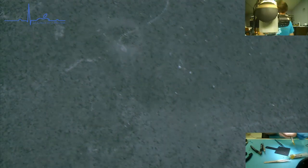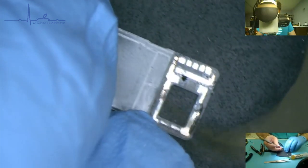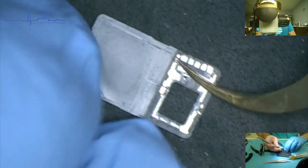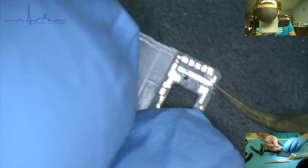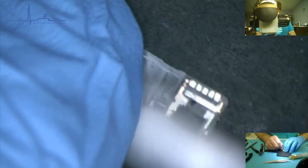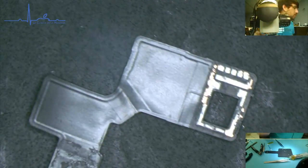So, for the sake of practice, let's go ahead and put it on this one. To do that first, we're going to do a little touch-up with UV coating. So this is the disposable part here, that when you're buying the kit, I guess there's actually two different kits right now for it. One of them is a sandwich, that basically you stick the chip here, and then you put your dot projector back on top of it, and the other one is actually a completely new flex that has a programmable chip on it.